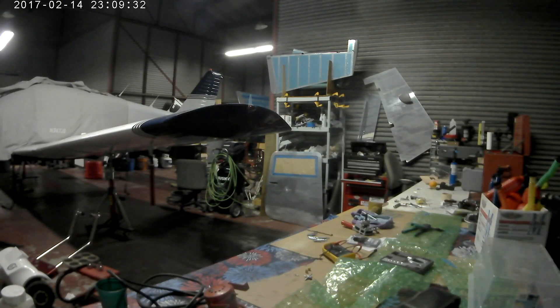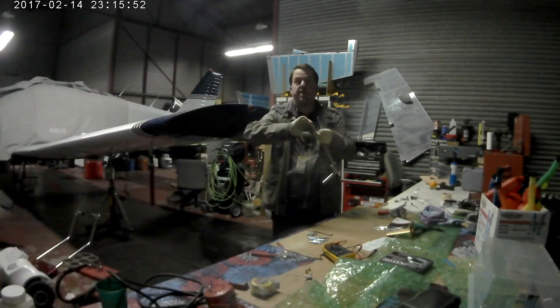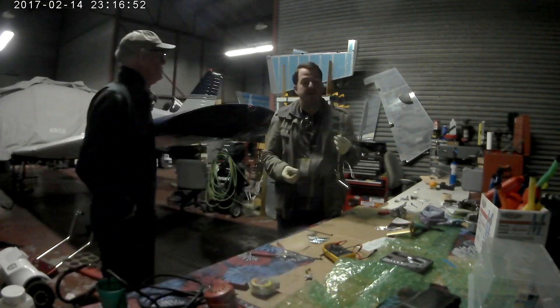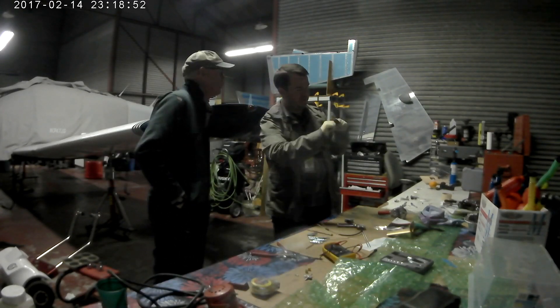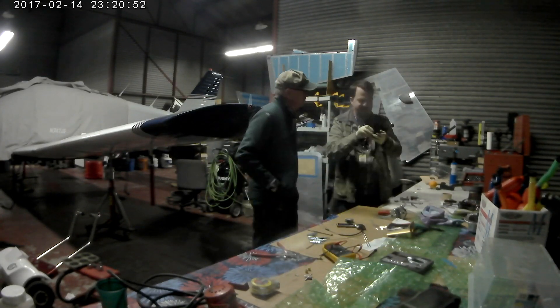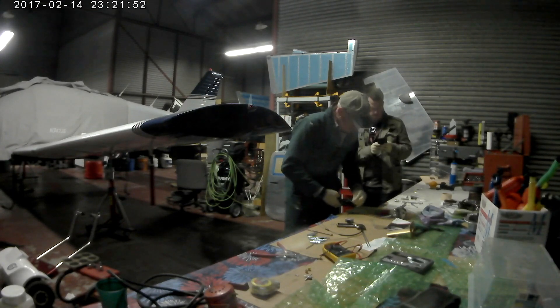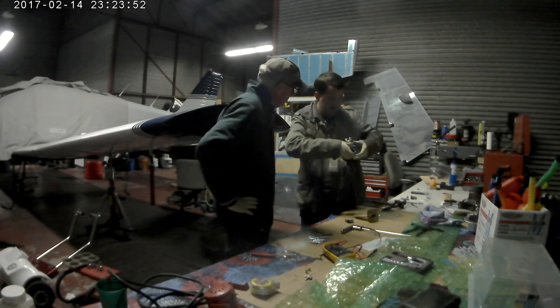I've gone back and put the pitot tube back into the mast, into the wing. I've got the 8-inch lines drawn around the tubing — which I don't show you because I'm an idiot — and I go to make sure it's in a nice space. With the tubes cut where we did, which was actually 10 inches, it's no problem. There's plenty of room. It's a little bit long, but I've been planning on using 90-degree elbows anyway. The decision was just made to cut it at 10 inches. Besides, if it's too long, I can just go back and cut it again.